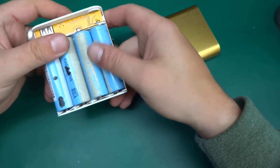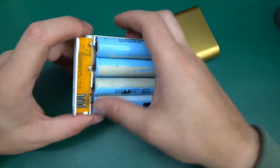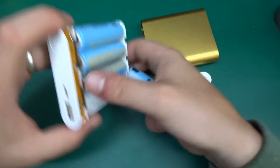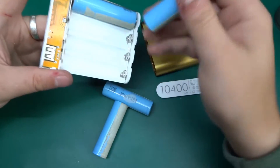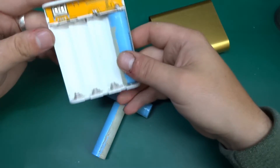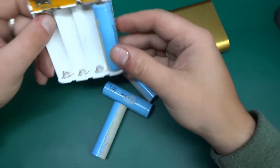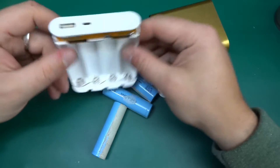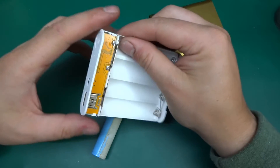The batteries are connected in parallel — all four 18650s. You could use it with just one battery and it works fine; you can put two, three, or four in. It just changes the capacity; it will still work absolutely fine with a single battery, so it's quite handy as a multi-battery setup.